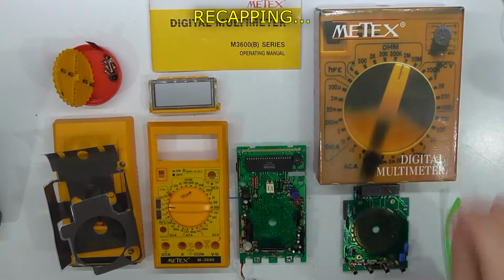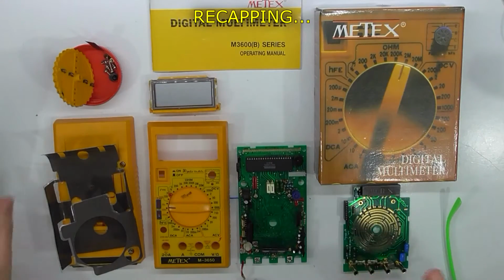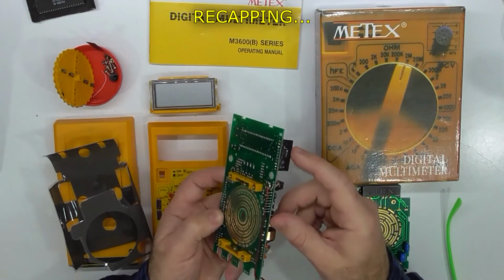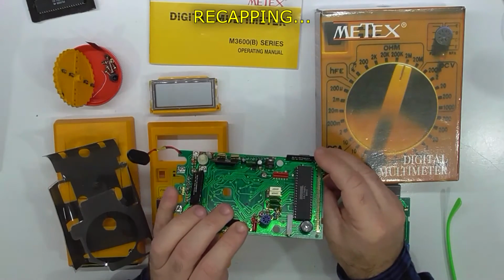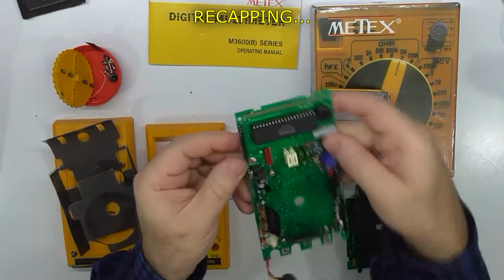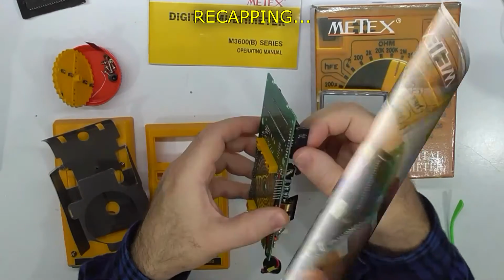I bought this meter back in the early 90s. I do know that I blew it up, and specifically it blew up the chip here. Reconfirmed that this hybrid module, the SDG HD03R, is the one that's faulty. In taking some photographs, I bent the chip and the damn thing broke most of the leads.